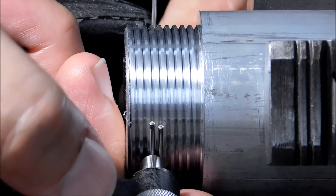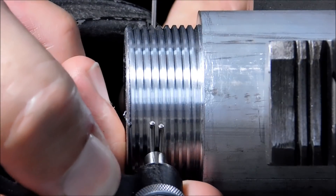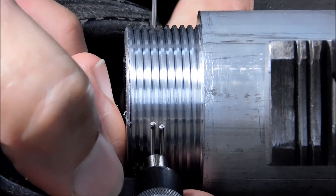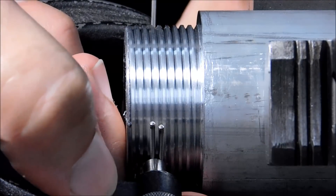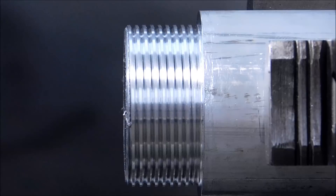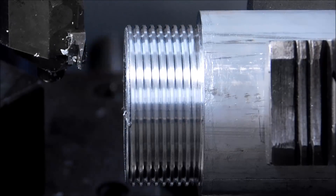You'll feel the micrometer sit over the wires — use three-point contact and just rock it back and forth until you're content. We're looking at around 1.776. The numbers tell me we are twenty-eight thousandths away. I'm going to go twenty-five and check it.